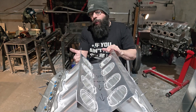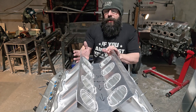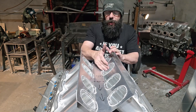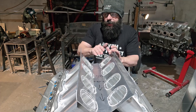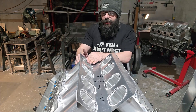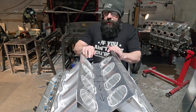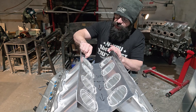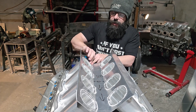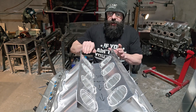Now we've got the plenum welded on, we're going to flip it over and I'm going to start welding on the underside. This is a particular weld we need to get right because that's the strength weld. The inside weld is nothing but the formation of the radius — most of it will disappear when we port it. When we weld underneath, we need to make sure we get enough radius so that when we port this radius, we're not thinning out the metal.